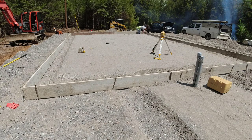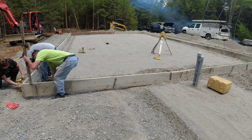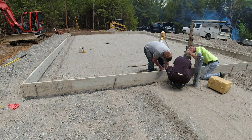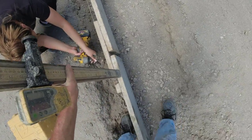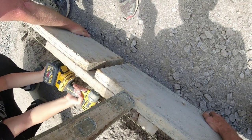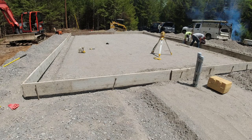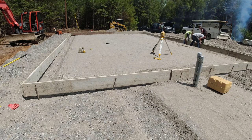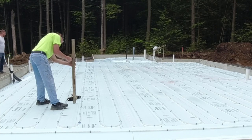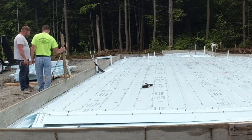I'm going to check my grade. The guy ended up grading this to within about an inch, so I'll take an average of that and raise the grade stick six inches - actually eight inches - because he's putting two inches of styrofoam down, and that's what we're going to use to set our forms to. The builder will put two inches of styrofoam down on the flat part in the middle and also down inside the haunch. As I lift the form up off the gravel, the two inches of styrofoam will fill up that gap. After we get everything set to grade, the builder comes in with his styrofoam - you can see the plumbing over there where the plumber came in and did his thing - and then the radiant heat guy staples down his radiant heat tubing to the top of the styrofoam. That's what's going to heat the house.